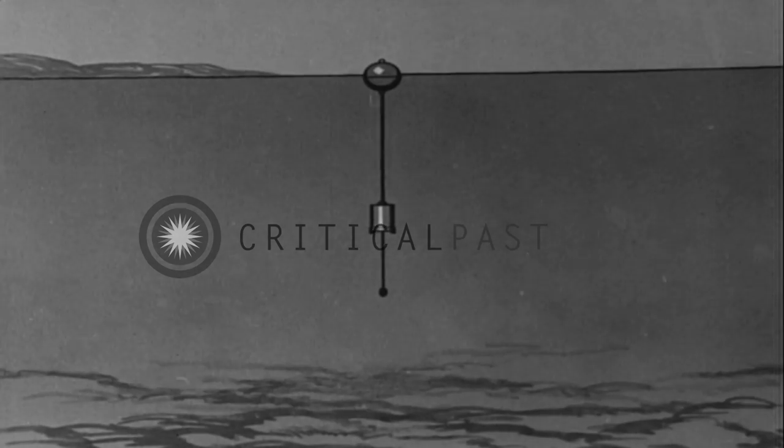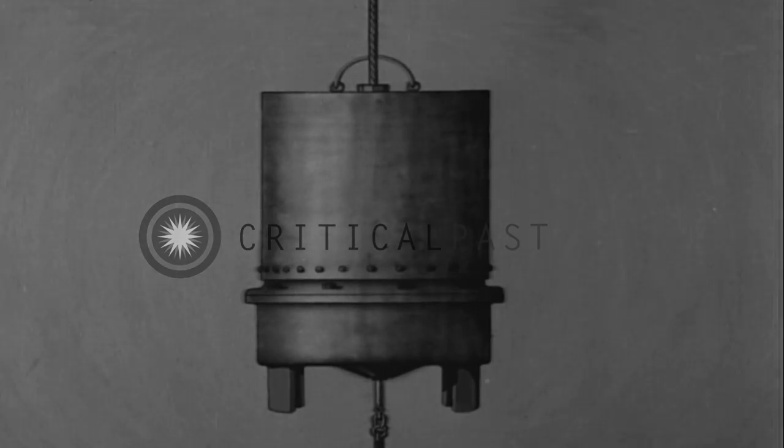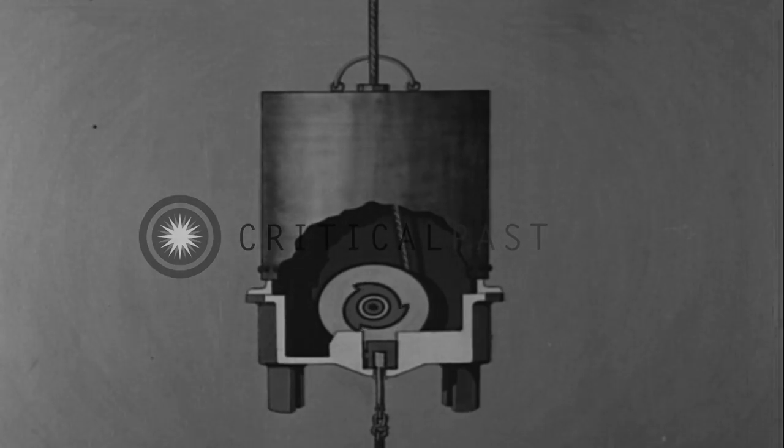When a mine with an automatic anchor is planted, the mine remains on the surface while the anchor and its distance weight sink rapidly. As the anchor descends, it pays out mooring rope from a built-in reel. Here, the cover has been removed to show the action of the reel.